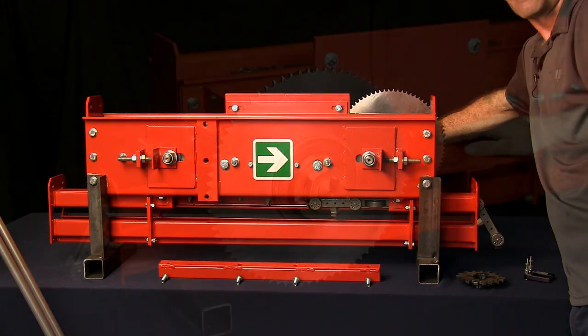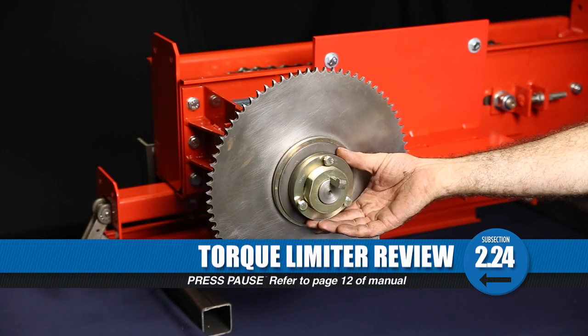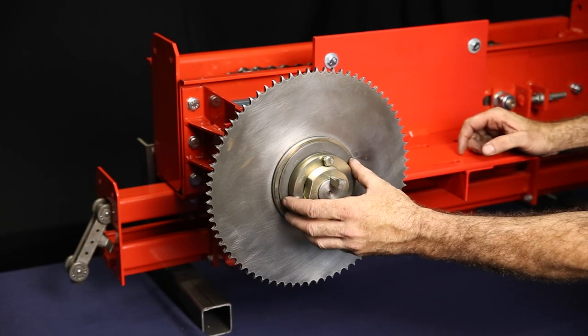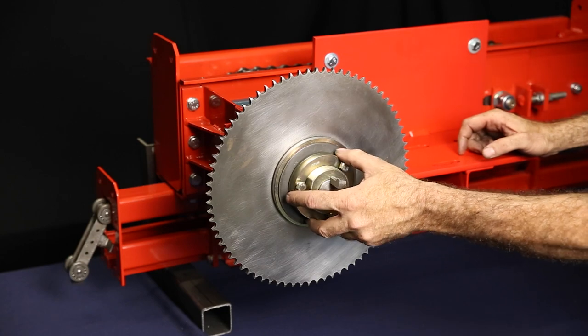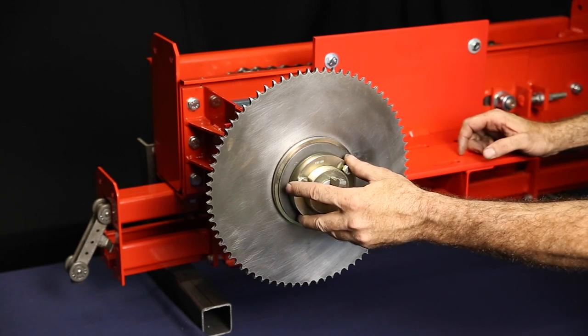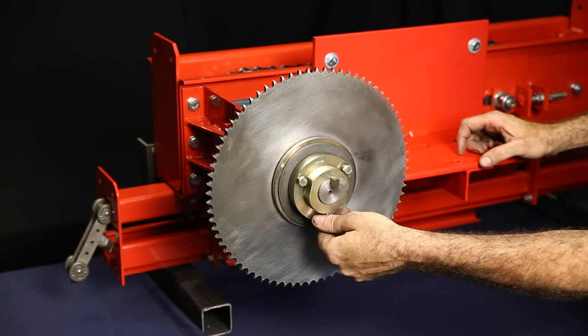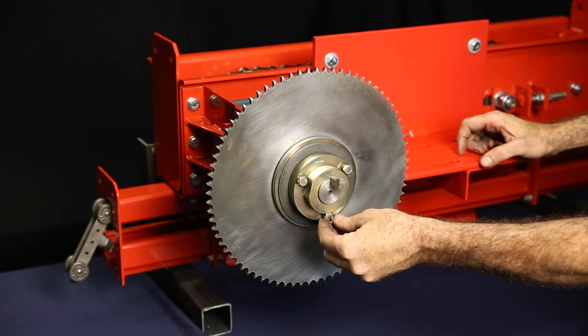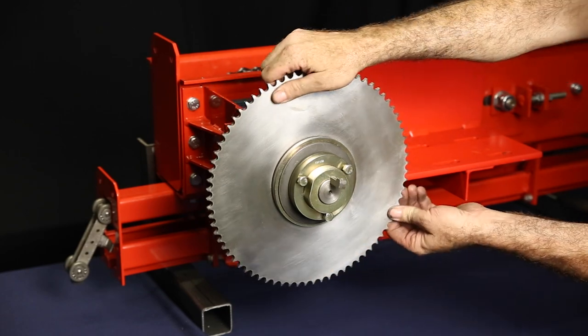In the back side here there's a main drive sprocket which is attached to a clutch. Adjustment of the clutch is done from this side. This is a Moore's torque limiter clutch. It consists of a pressure plate, a friction disc, and a spring. Basically what you do is tighten it up to zero torque and tighten these three bolts evenly a quarter turn at a time until there is no slippage on the disc.